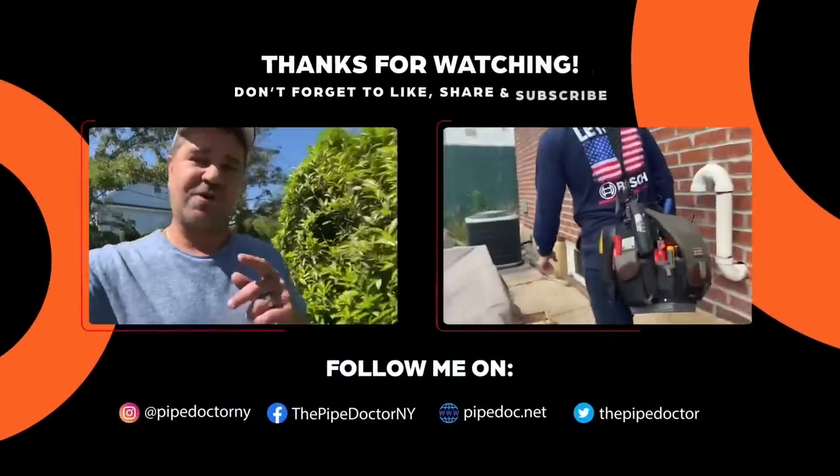Alright Peter, what'd you think of that service call with the Hayward Heat Pro? I do them all the time — similar to when you do service calls with Daniel on central air conditioning, it's identical. I heard the lack of the compressor firing up and immediately went to capacitor, because that's generally what it is. And great news — we left an estimate for a Bosch iDS 2.0 four-ton heat pump system before this call, and I got a text that they approved the install. Stay tuned next week, guys — it's going to be tits.